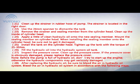27. Inspect the pressure cover. Clean up the pressure cover. If the pressure cover is obviously damaged, please replace the pressure cover. Note: before the pump is full of hydraulic oil, don't try to start up the engine. Otherwise, the hydraulic components may get seriously damaged.